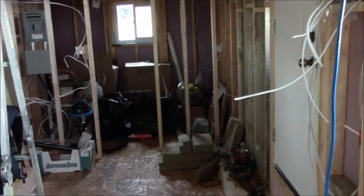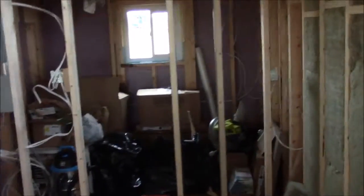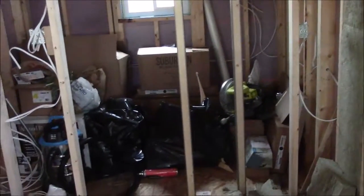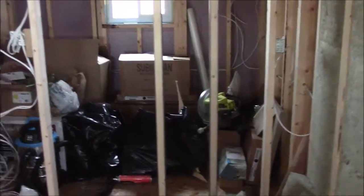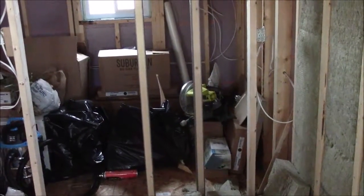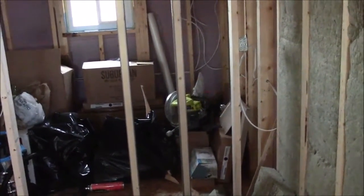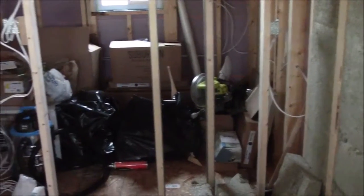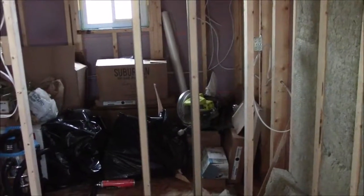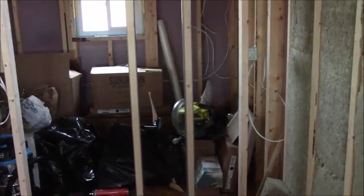Also did a little bit of research on batteries. And most likely I'm going to go with some large 30 or 31 size AGM batteries. AGM batteries, they don't off gas at all. You don't have to worry about adding distilled water or fluid levels. They can be put on their side or upside down. You can mount them any way you want. They tend to be able to go through more charge and discharge cycles than regular flooded lead acid batteries.